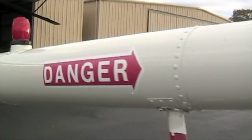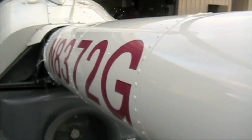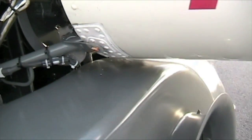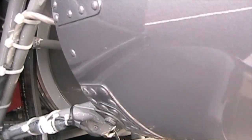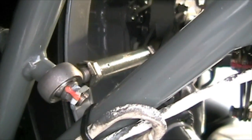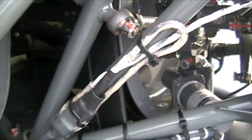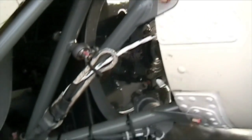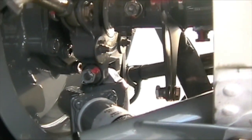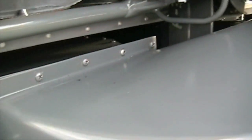Here's your blade — we're going to inspect the blades. You're looking on the leading edge primarily. On the R22 you're checking for cracks, nicks, and chips. On the R44 — not the R22 — they had some problems with trailing edge cracks. Place your hand here, not on the blade itself, and inspect the blade. Coming down the tail boom, checking all the rivets — get a good glare going down the tail boom. There are three attachment points on this side, two on the other. Check the rivets — none working themselves out. Here's the stabilizing tube for the upper bearing. Make sure torque stripes are good and the wiring harness is properly secured. Check the fan shroud — make sure all screws are nice and tight.